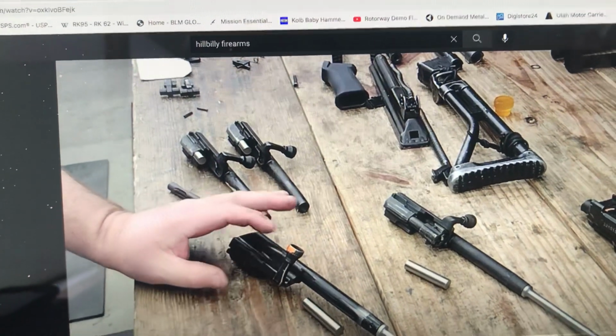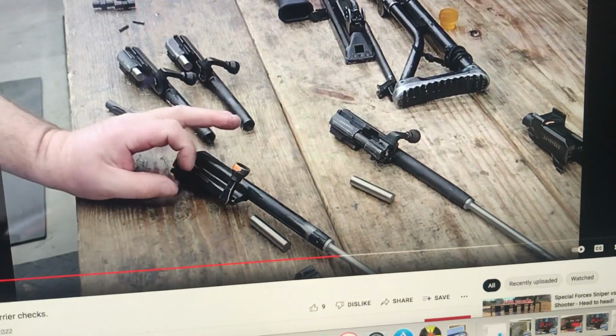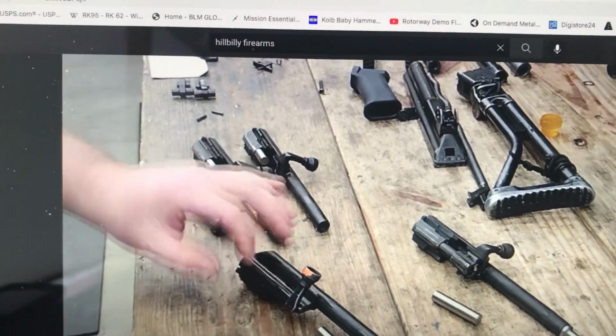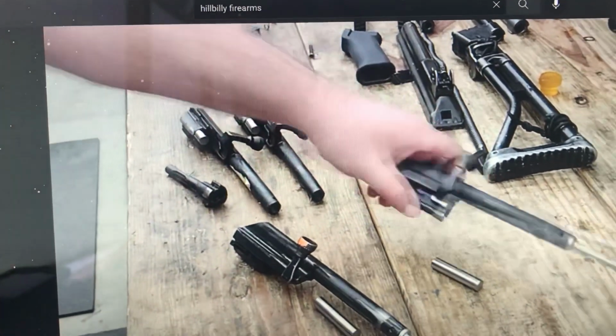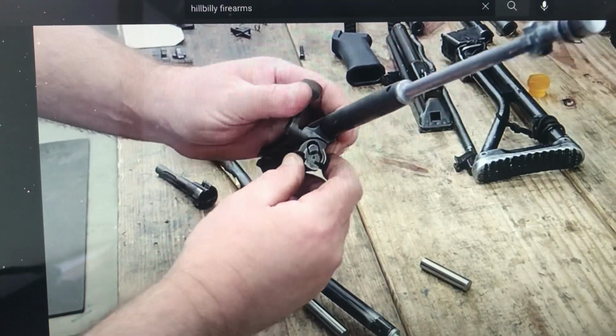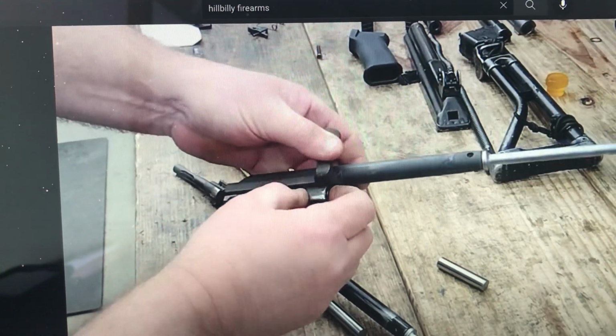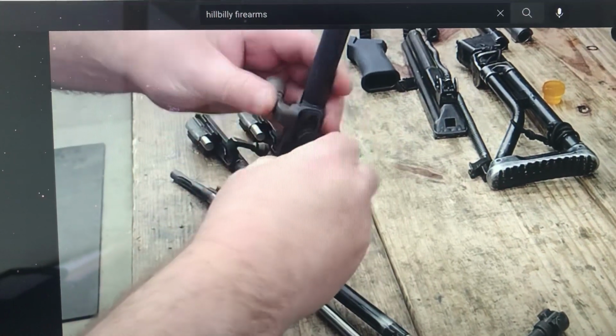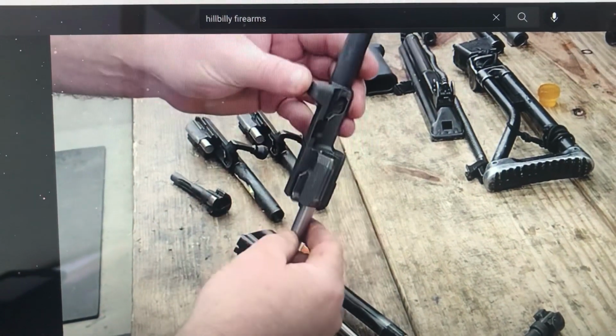438 on a used one is kind of close. I only want to go somewhere between 8 and 10 thousandths before I start worrying that the bolt is going to have problems like that. Okay, so that one should be 437 and a half.